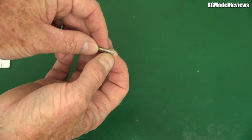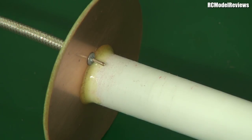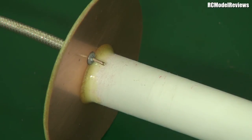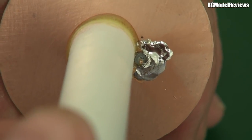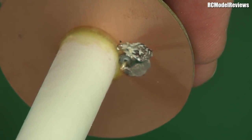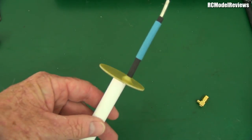Before putting the spiral wire on, I'm feeding the coax through so I have something to solder the end of the spiral wire to. Prepare the coax end by pulling back a bit of the outer braid and spreading it out, leaving a bit of the inner conductor showing. If you're not great at soldering this next bit might challenge you a little - I need to solder the outside of the coax braid to the copper back plate.